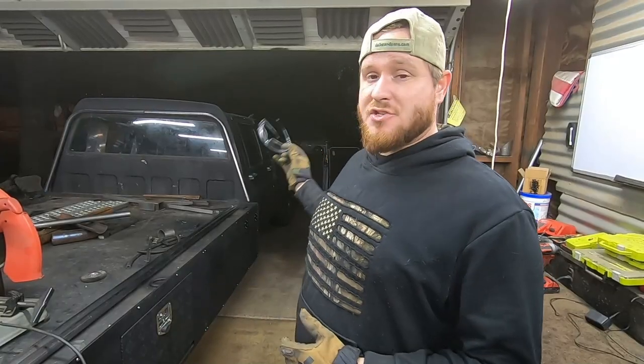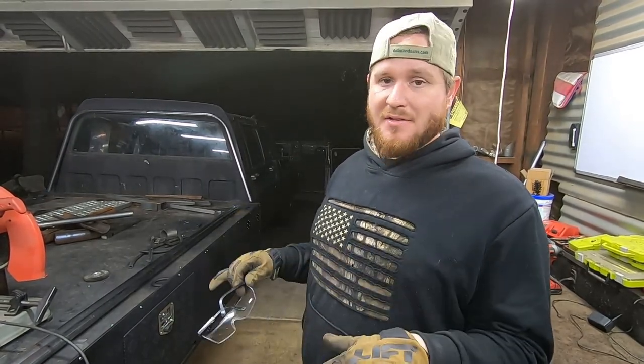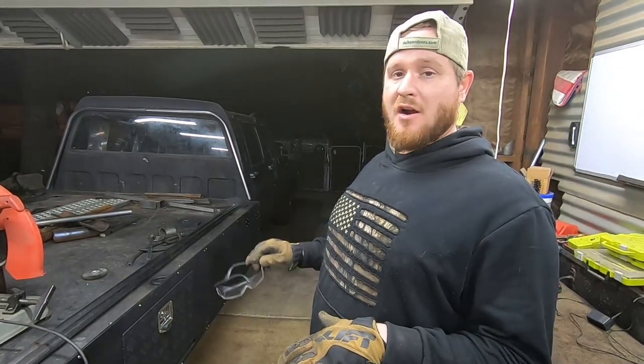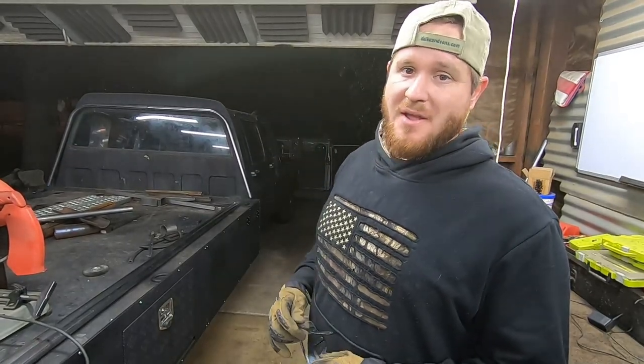So now I'm gonna go ahead and trim up the bottoms so that they're gonna sit at their final height before we put in the plates that they're gonna be mounted to permanently. But that'll give us the ability to tack it to the bed directly and start working on our other tubes for now. So cut it, tack it, move on to the rear main tubes.